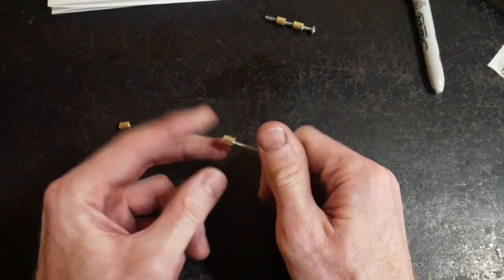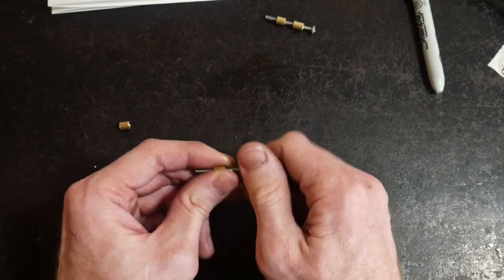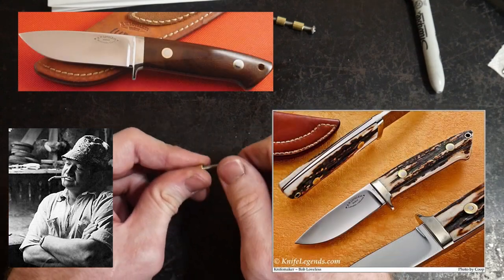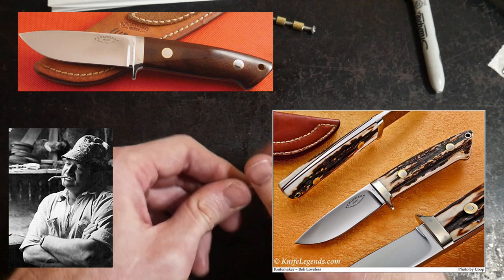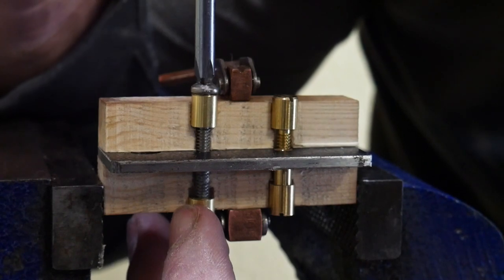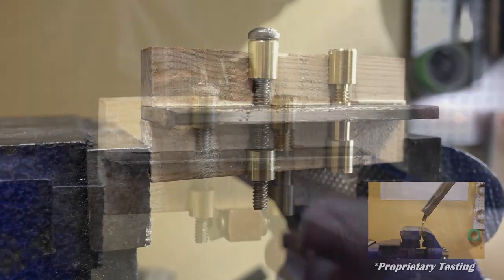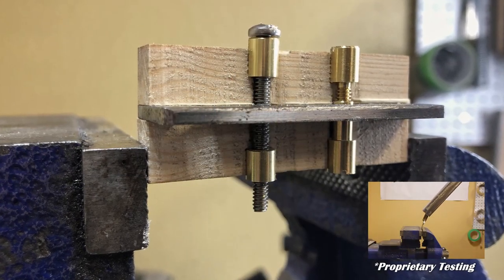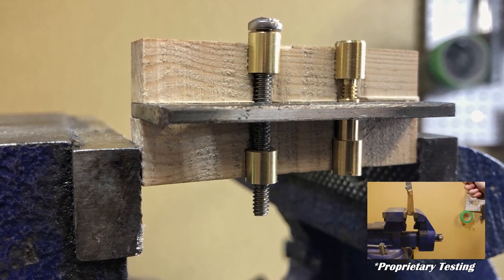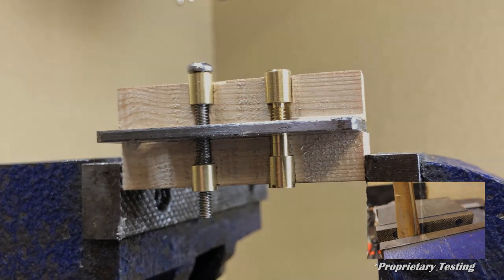Welcome back to the shop. Today we're going to be covering Loveless bolts in their entirety. These fasteners were made popular by the legendary knife maker Bob Loveless. They have a distinct fisheye look and also provide a solid mechanical connection for your handles, not unlike the Corby fastener. While having Loveless or Corby fasteners on your handle scales is not a necessity, they increase the strength and durability of your handle construction. This is why I include at least one Loveless or Corby fastener in every full tang knife I produce.